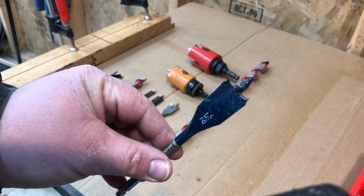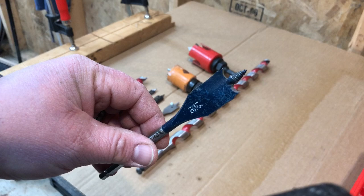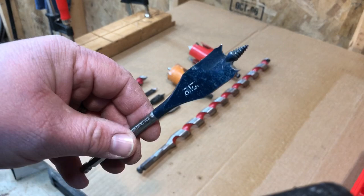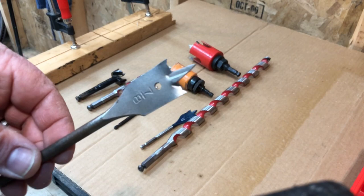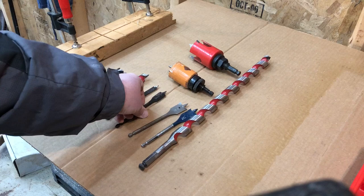I don't know if he's been using the kind with the auger point — the self-feeding point — but the fact that it has a self-feeding point is a dead giveaway that you are not supposed to drill that on high speed. These are nice and they've got their place in my arsenal, but I don't prefer this type. Here's another type — also a Bosch — and it doesn't have the self-feeding tip. That's just a standard paddle bit with little crowns or teeth on it.